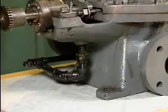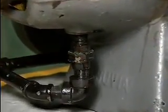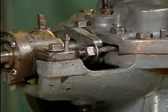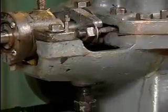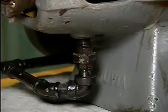The slop drain provides a path for the regulated leakage from the stuffing box to be directed away from the pump and into the drainage system. The slop drain in this example is in the bottom of an extension on the casing that forms an open well to catch the leaking fluid.